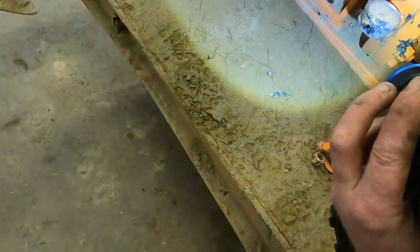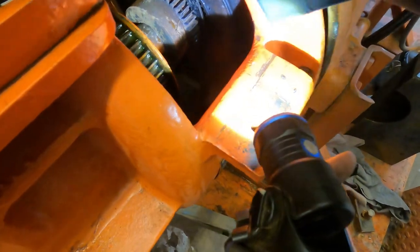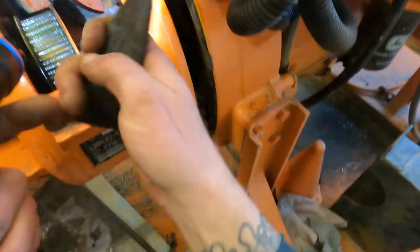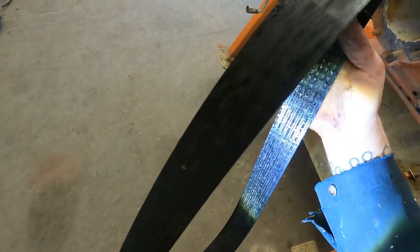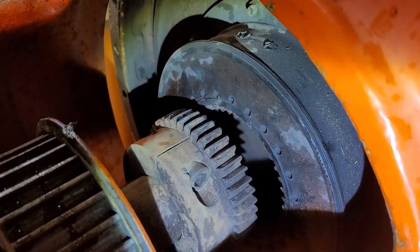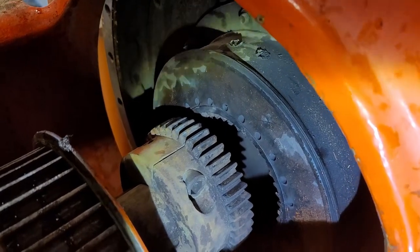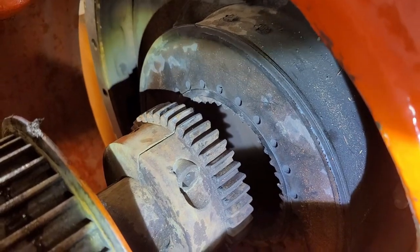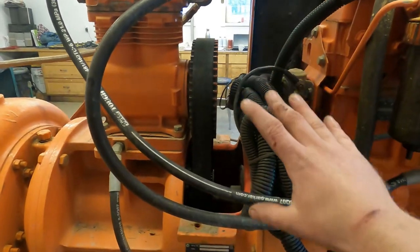Hopefully this thing does not fall off that perch. Okay, that's going to be plenty enough room — let's slide this guy out. There we go. This looks like a serpentine belt now — not even a cog on it. This blind adapter slides into the engine. The piece on the engine is actually a very hard plastic — it's designed to break if the pump ever sucks up a large rock or a stick. This one looks like it's in good condition, so I'm going to keep it in and run it next year. With the new belt put on and the tension back to factory specs, we can put this thing back together. Okay, we've got everything back together — the belt is on, the tension is adjusted, we can put the safety cover back on. This pump is done.